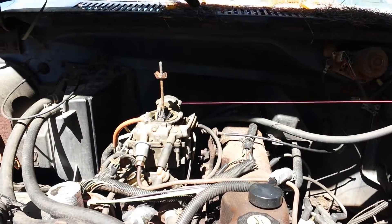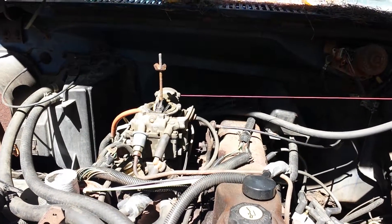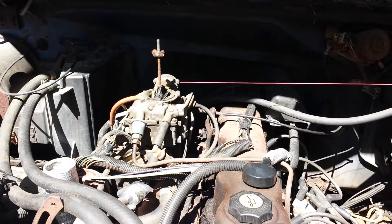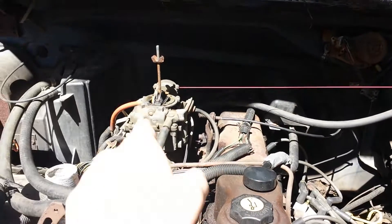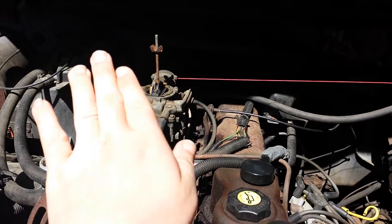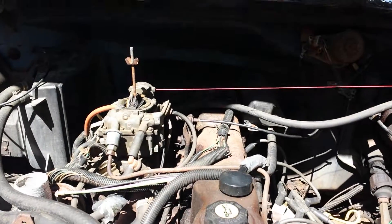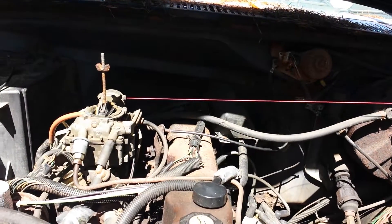What I'm doing is using a rubber band — you can get it at Walmart, like 20 feet of it. I'm making the choke close so when you go to start it, it stays closed. But when you put throttle into it, the airflow opens it up — like fast and furious, step on the gas and it opens, let go and it closes. Up and down like that. The rubber band setup is something interesting I'll have to show in another video because I don't have a lot of time left.